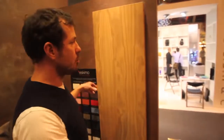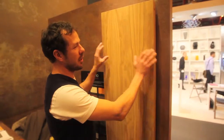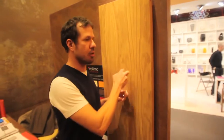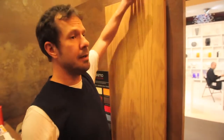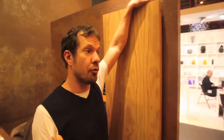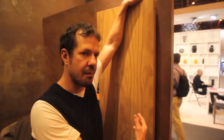Let me tell you about Woody. Woody is the world's first wooden radiator. Lots of people ask will it work for bathrooms or humid environments. The first thing we did before we launched the product was test it in a humidity cabinet, where we kept spraying water at it every 20 minutes, let it dry off, heated the whole thing up, cooled it down again — repeatedly — for six months. After six months we decided that was okay and released the product. Absolutely no movement in any of the joints. It doesn't de-laminate. It basically lives in the most challenging environments and still holds up.